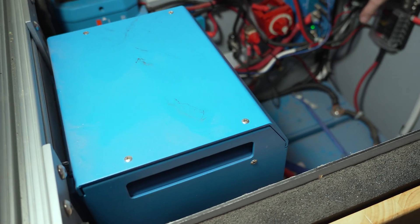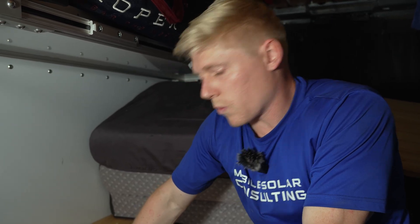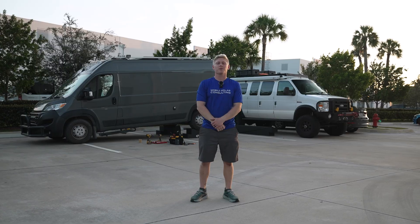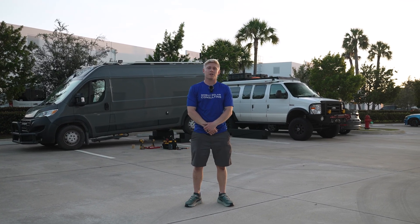What we did not yet get to was fixing the inverter — the MultiPlus still does not have any signal coming from the BMS. Unfortunately we didn't get to that today, but the way to fix it will be to use an inverter remote on/off cable with the MultiPlus into the BMS, along with a little programming in the Assistants tab of the config that allows the inverter to take those signals into its temperature sensor or aux inputs, and know when it should shut down and when it should go into charger-only mode. I hope you learned something from this video — if you want to see us fixing up some other common mistakes, you can watch the next video.